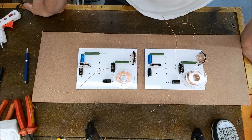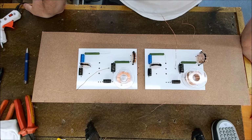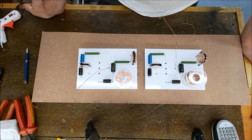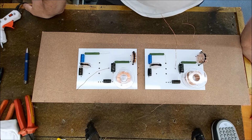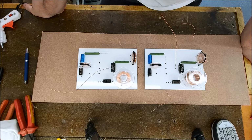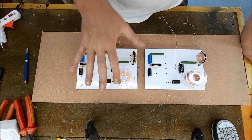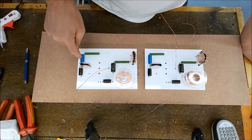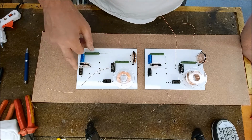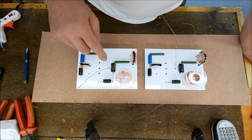And if we went with polycaps, we would probably do that. I've had a few pairs of these before and done that upgrade on them, and it does change them. It can make them a bit more accurate, but they kind of lose that British sound, that warmth they have. So I'm basically copying the crossover with brand new L caps, electrolytics, which is what they were fitted with, bipolar.